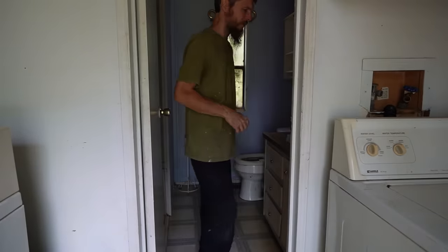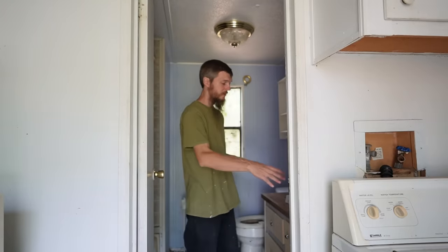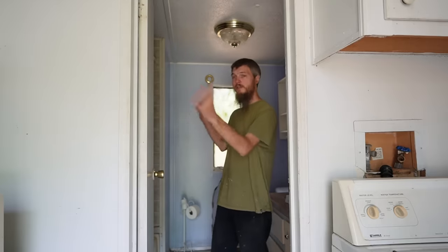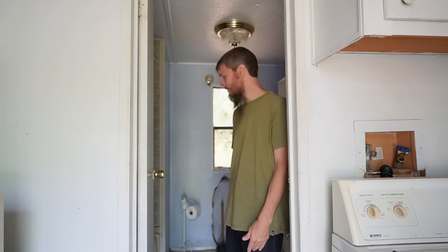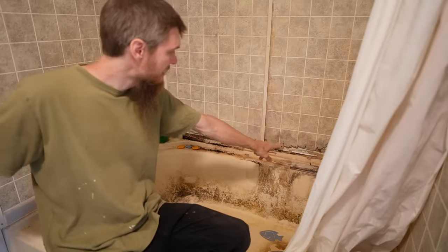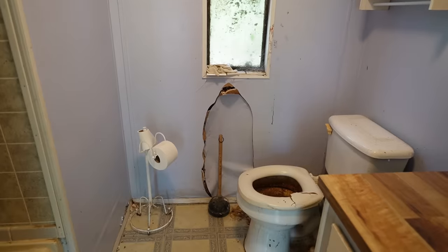Let's get into the bathroom — the room everybody wants to see. It's a small bathroom, nothing special. We have a pretty good-sized sink and countertop, a vanity, and a toilet. There's also a large shower bathtub. The bathtub has paneled walls and those paneled walls have decayed — that's where the water is getting into the bedroom floor. Whoever was bathing, the water runs down the wall, goes behind the tub, and is ruining the floor in the bedroom. The whole bottom of the wall board used for the shower surround has decayed to the point where water easily slips back there.